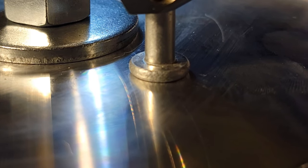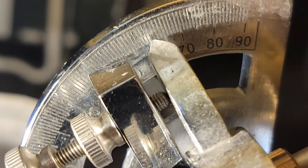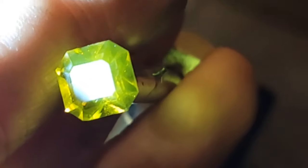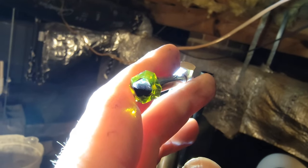Once I have it flat I slowly raise the vertical angle setting with the bolt until the flat dop just barely raises off the lap, then lower it back down until it's perfectly flush. In this case the ideal vertical angle was 61 degrees. Now I raise the handpiece up, remove the flat dop, and put in the dop with the gem. The table is ground in with a 600 grit lap and I like to hold right on the stone to avoid any rotation. Once it's ground in it's time for pre-polish, which can take a little while to cover the entire table. And finally the polish — before I get going I use the Sharpie to get the alignment on the lap just right, rubbing the table against the lap and raising or lowering the handpiece until the Sharpie gets rubbed evenly. Now a fresh charge and a long slow wait until the facet is completely polished. As with other facets, if it comes more on one side you can gently push in the other direction — but be very careful and very gentle.